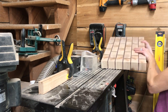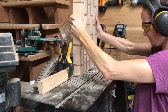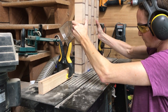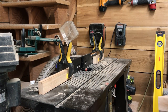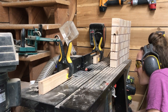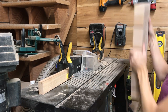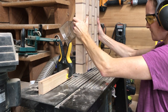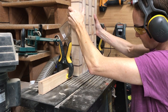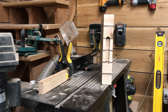Here I made a stupid mistake and put in the finger grips first. Make sure if you do this to do the round-over first. Because I had the grips cut, when I made the round-over cuts on the sides, the wheel of the blade didn't have anything to rest on, so it dipped in a bit. I totally kicked myself for not sticking to my process. The bit for the grips was already in, so I figured I would just save a step and start with it. On the flip side, I guess I'll never make that mistake again — sometimes it's best to learn the hard way.